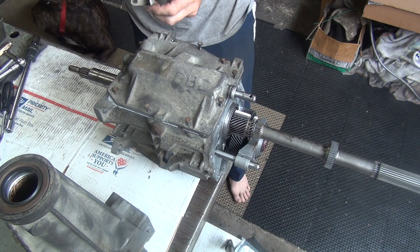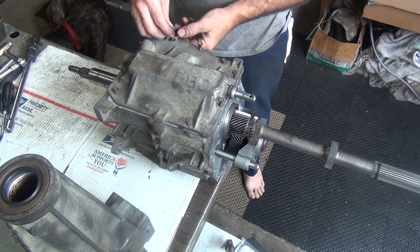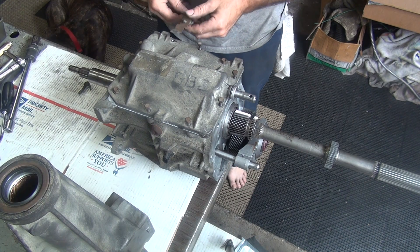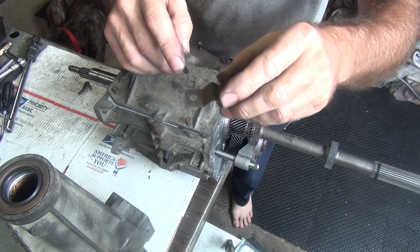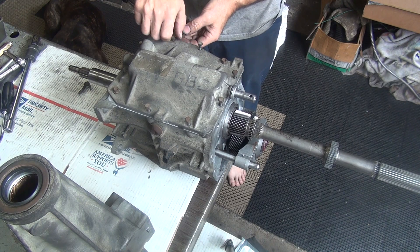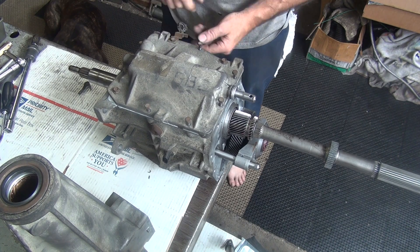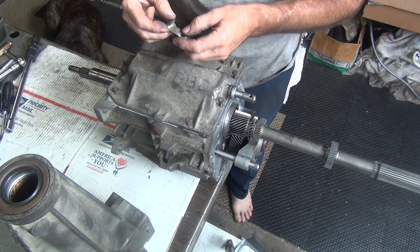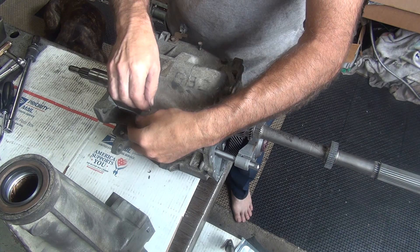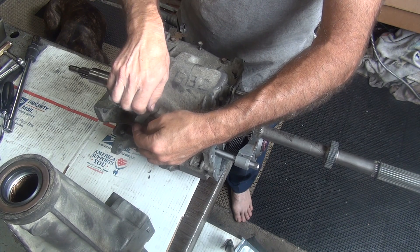This one I'm not using. I think it was on one of these forward ones, and this one here is holding some kind of a wire up. Going by the shape of it, it was this one — you can see how the mark was. This was up because it only has the bolt mark on it, so this one goes over here. It's supposed to have a cable going up there — I think it's like an O2 sensor connector. The other place there's a mark is right here in the case — there's a round mark, and so this goes right here. Even though I don't know where all the parts go, you just kind of look at the evidence left behind and it gives you an idea of where it goes.